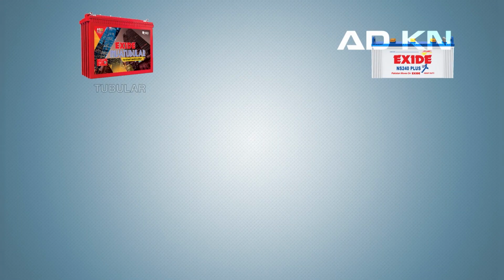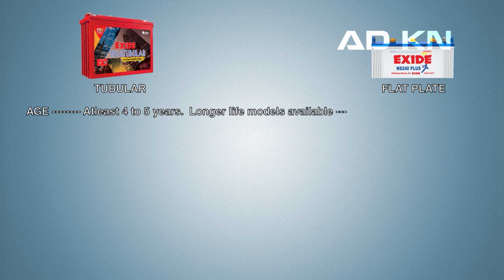Let's compare tubular to regular flat flooded batteries. Number 1. Tubular batteries can last for at least 4 years. The one I am using will work fine for 5 to 6 years. And there are models which will work even longer, for like 8 years. Flat plate batteries cannot be used more than 3 years, and even in the 3rd year they will perform poorly, so you might need to change them after 2 years.